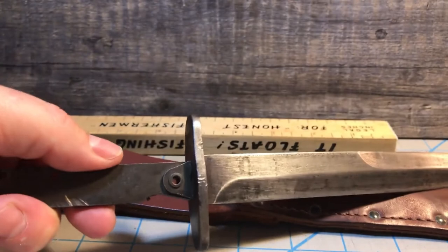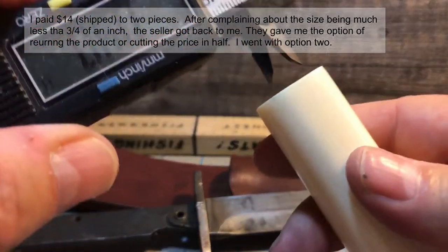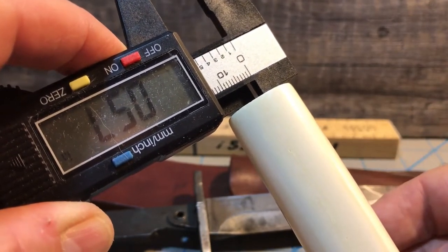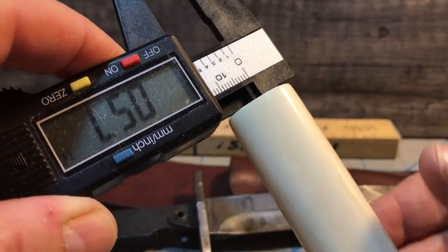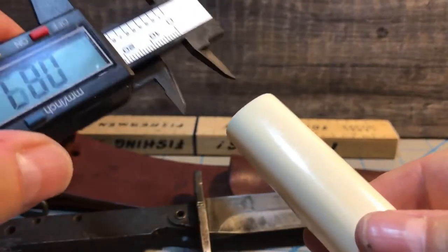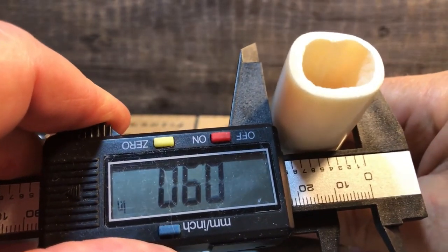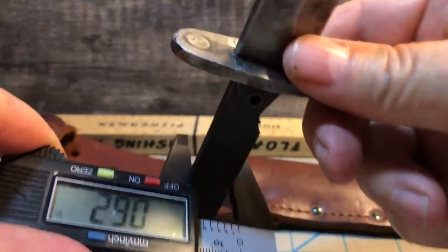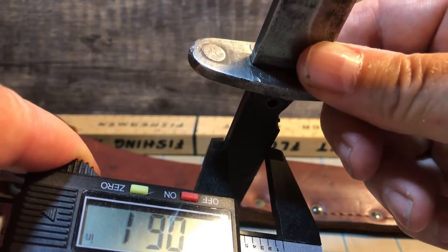The hole in the middle is not 0.75 - let's see what it actually is. Here's my caliper. The widest I'm going to be able to get it is 0.57, which is just the opposite of 0.75 - basically 5/8 of an inch, a little bit smaller than I need. I needed 0.65 at least, and they lied. The overall diameter they said was an inch and a half or an inch and a quarter - well it's less than an inch in diameter. Right here it's 0.62, down here 0.61.